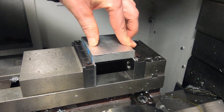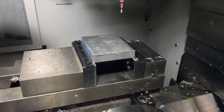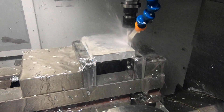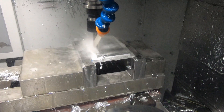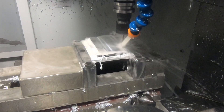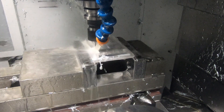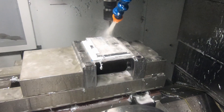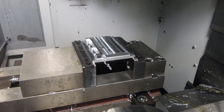The idea is simple enough: you take a piece of material that's thicker than what you need for the final part, pick up one corner, and then mill essentially five of the six sides in one operation. So I can mill the top, the left, the right, the front, and the back sides in one operation. Once that's done, I flip it over and mill the other side — a lot less work than milling all six sides in six separate operations.